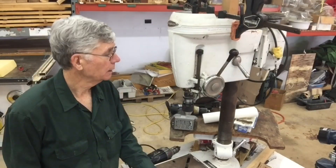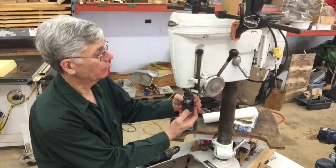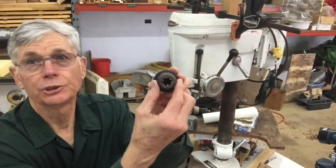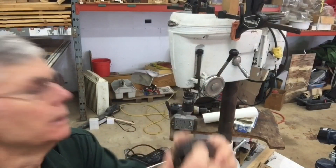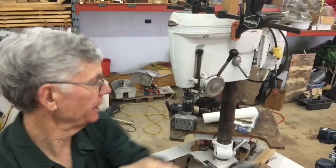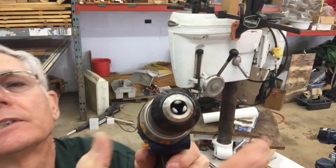Key takeaways: it's got to slip somewhere, but it definitely seems to be true that this chuck is self-tightening and self-loosening going back the other way. Not all chucks are like that — with the Jacobs chuck that was on there, when you turn the collar the jaws stay still. This is an old key chuck 120-volt and the jaws stay still, and a Ryobi — not too old, somewhat old — and its jaws stay still.